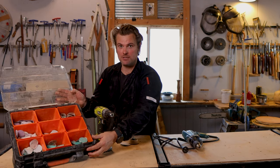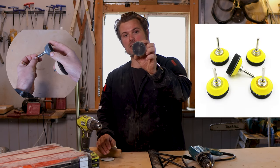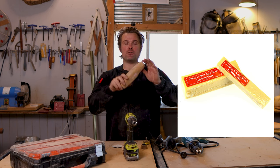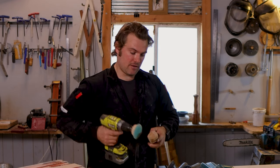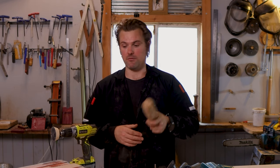Having all your sandpapers organized is crucial. I have a nursing trolley with all my sandpapers in little compartments. Another thing when it comes to sanding is these little Velcro attachment pieces — you put them in your drill and away you go. I've got a three-inch, a two-inch, and also a hard-backed one. Also, a rubber cleaning stick — predominantly used on belt sanders — when you hold it against a gummed-up sanding disc, it cleans it off and makes it good as new again. It'll save your money in the long run because you'll get more life out of each sanding disc.